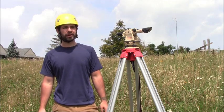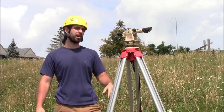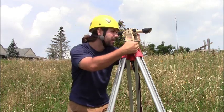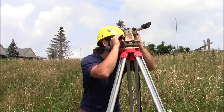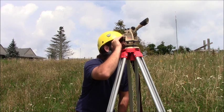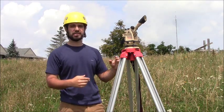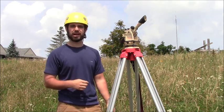We've pulled in some slack on our rear guy wires, keeping in mind that we wanted to overcompensate just a little bit so the tower is leaning just a little bit to the uphill side. We're going to come back to our transit, which we haven't moved, get the crosshairs lined up on the bottom of the base using the fine adjustment, and work our way up the tower. At the 75-foot guy wire level, we're just a tiny bit on the uphill side of plumb — exactly where we wanted to be. Now we can transfer over our guy wires after we've got the turbine installed, get our final installation set up, and then let out just a little bit of slack on that uphill guy wire side to get the tower perfectly plumbed.